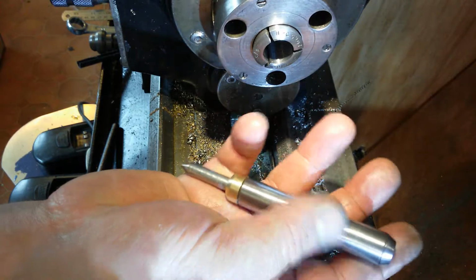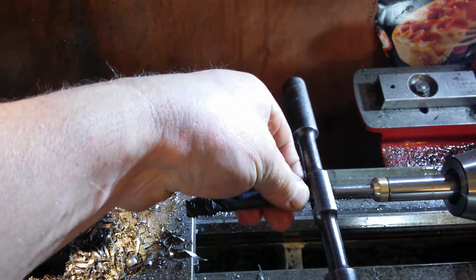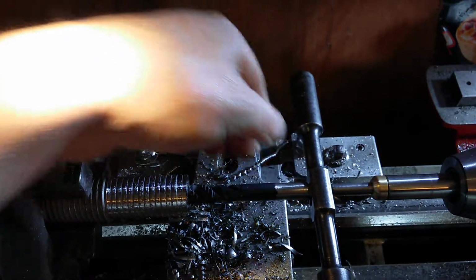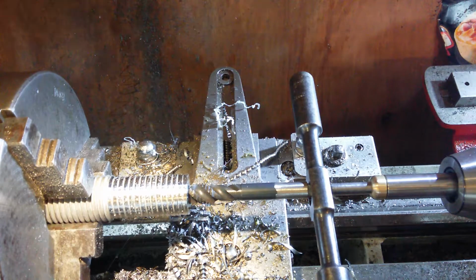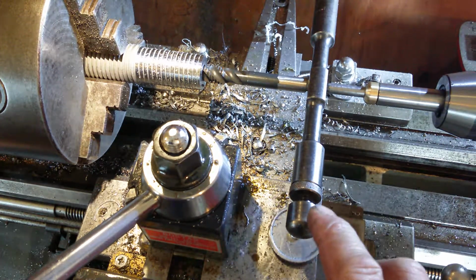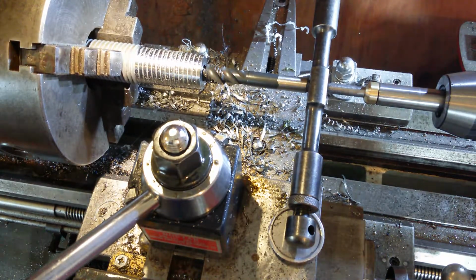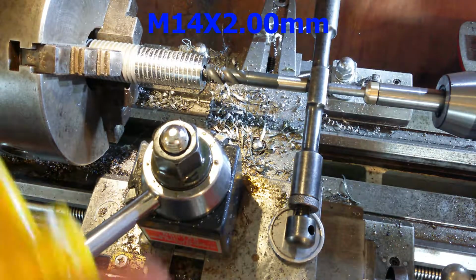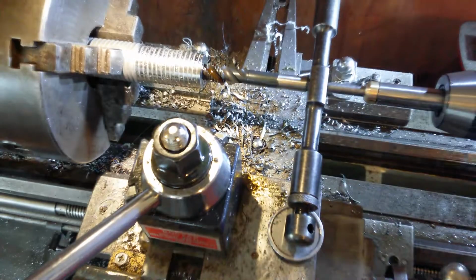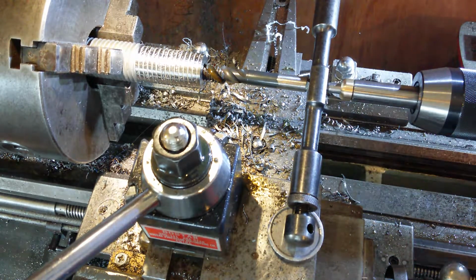There she is. Now I want to tap a hole and see how good she is. But the tap goes into the jig. We are there. Just bring it back. So I've got a piece of aluminium, which I'm going to rest up there. Okay, like that. And then we're going to put some cutting oil inside there, like that. And locked on there, so I'm going to put some tension on the tapping jig, like that. And away we go.